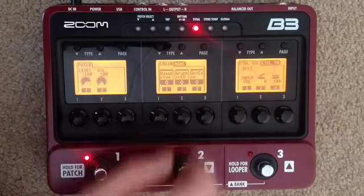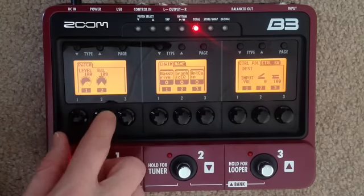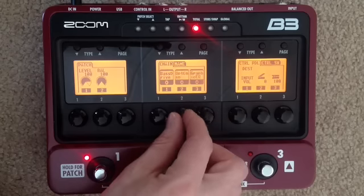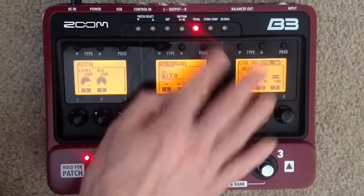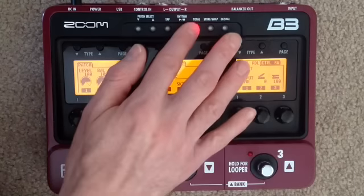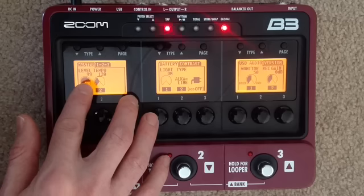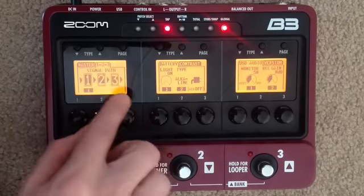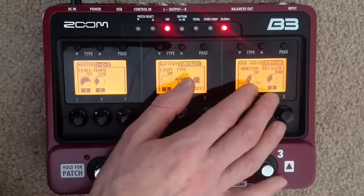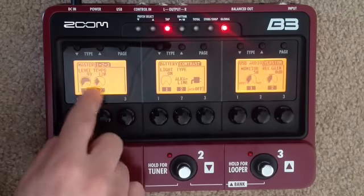The total screen basically gets me into the patch editing screen — the overall level of the patch and a wet/dry balance for your effects. You can change the order of the effects by twisting the wheels, rename the patch, and decide what your control pedal or switch is going to do. Under global: master level — the audio tech can change the signal level here if needed. You can also change the signal path, screen contrast, battery, USB audio for recording, and check the firmware version.